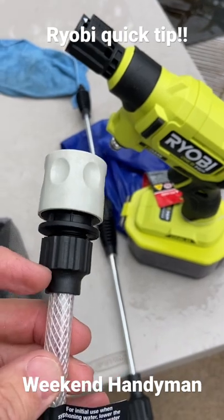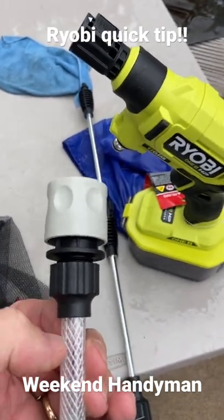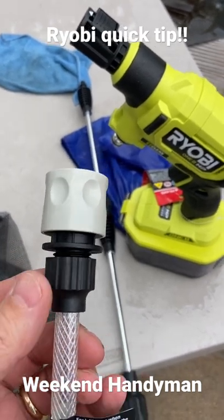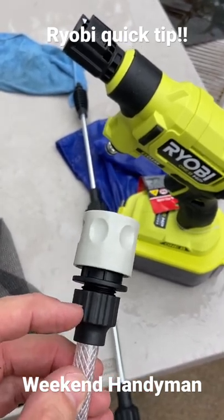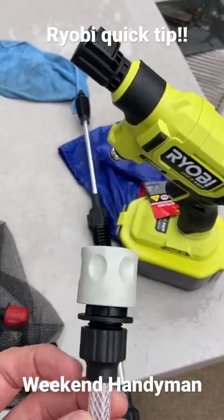— it's going to blow this connection apart and pull the hose out of the fitting. This is a compression fitting, so if you loosen it up, you can literally slide the hose back in all the way until it hits the stop, then push the collar back on.